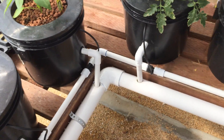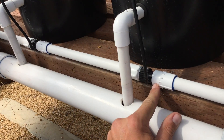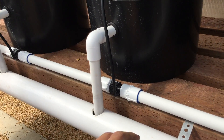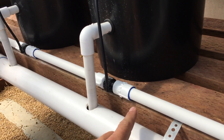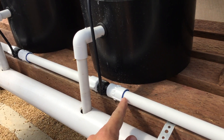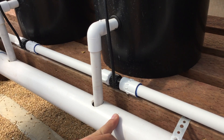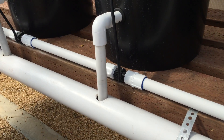You can see that the system is running off of that. You've got the female adapter, the piece, and here's the line that rotates — so if you're running it differently, you can swivel it any which way. Make sure when you're putting it together that you are PVC cementing all of your parts and also using threading tape around where you're screwing it in, because it will leak. The entire time I was testing it, it was leaking out, but not anymore now that it's been cemented.